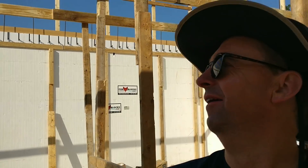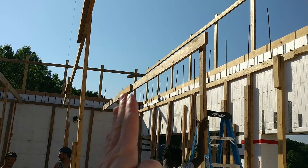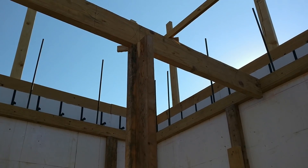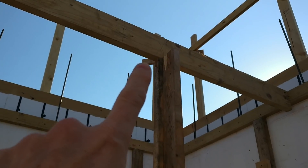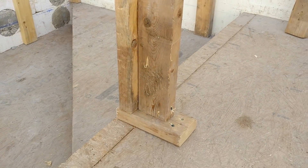Let's go over the process of how our spider web of bracing is going to go. We'll start with the temporary setup to get the two-by-sixes in line, then show you how the vertical pieces go in. We need to get this two-by-six along this line right here. Once they set the elevation on top using a string line — making sure it has the crown we talked about for the garage — the T comes down to the floor, and then they use a two-by-four down here.